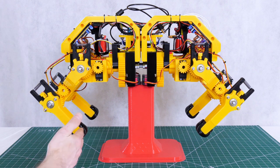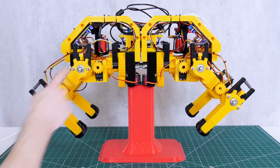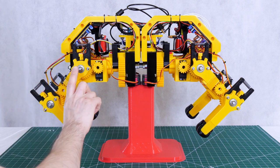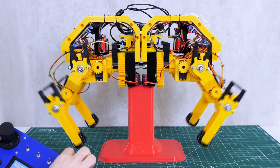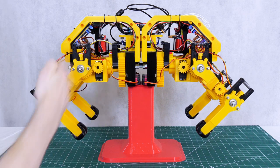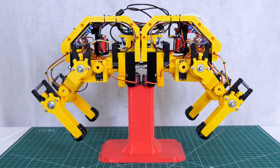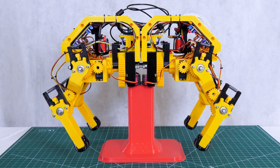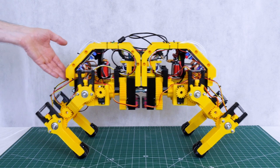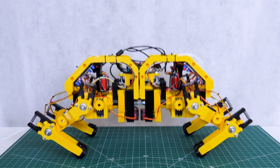The foot should always remain perfectly under the shoulder. We do have a situation where the knee servo has to move further than the hip servo, and both servos have motion filters on them — I'm filtering the servos individually rather than the actual Z demands. That means depending on how fast I move the stick, we can exceed the maximum speed of the motor, so one motor gets there faster than the other and it doesn't necessarily move in a straight line. To fix that we need to interpolate through every position on the way and drive it slower than the maximum motor speed. Having checked with a ruler and a protractor, my angles look correct and the leg moves to the right length. The robot is compliant anyway, so minor errors get taken out by the natural flex. The result is the robot goes up and down — that's the first axis of our kinematic model.